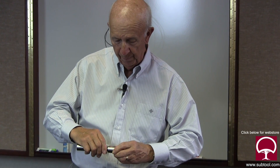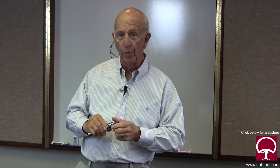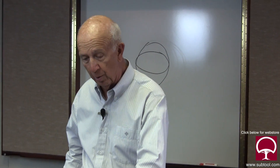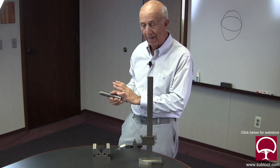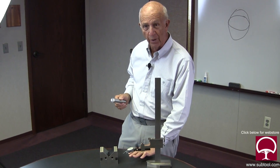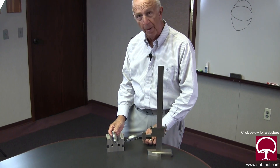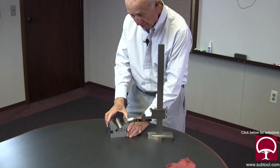For example, here we've got two diameters — an ID and an OD — and that is a beautiful slip fit, and so is this side. Now, checking this by feeling it, it doesn't feel like it's out of round to me. How would I know if it's out of round? Well, I could check the OD by using a v-block, and I'll show you what we're talking about. We normally do this in a QC room, but it happens to be tied up at the moment, so we're working on a Formica tabletop — not a granite surface plate — but this is for demonstration purposes.